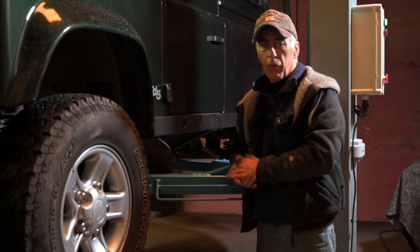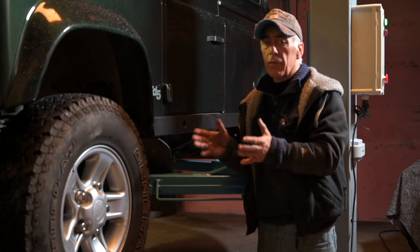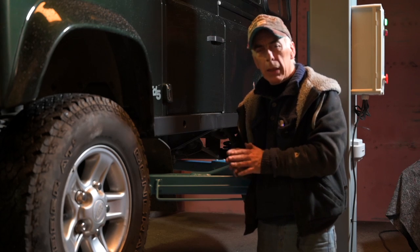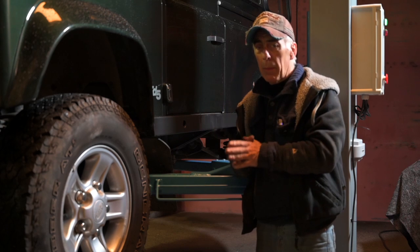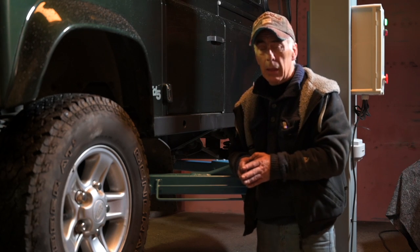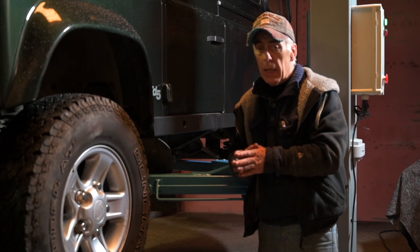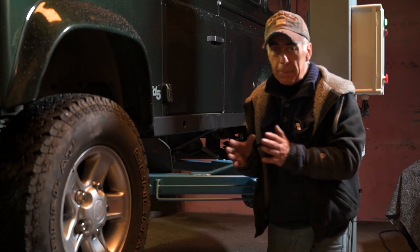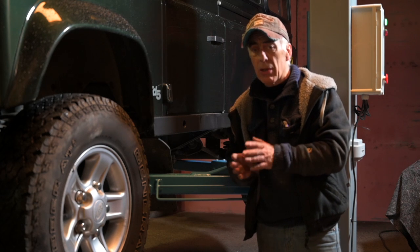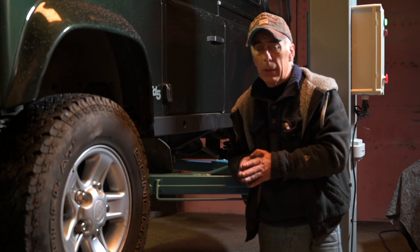My final conclusion on this two-column four-ton lift is that it's a very good and solid lift for the price you pay, and it is CE certified. The installation takes about 8 hours if you do it carefully — I've done it for the first time and it went very smoothly. There were small issues with the instruction manual especially on the control box terminal connections, but when I contacted Toolmania everything was sorted out immediately. I also had to drill an extra little hole for both the top and bottom sensors as one hole was not quite centered, but that's quite normal.